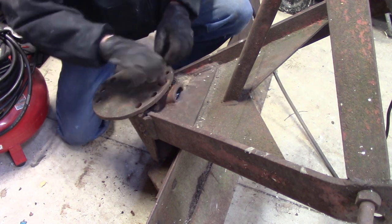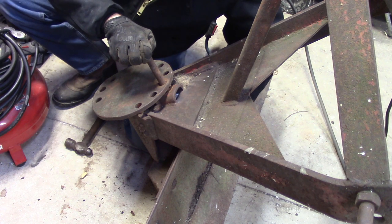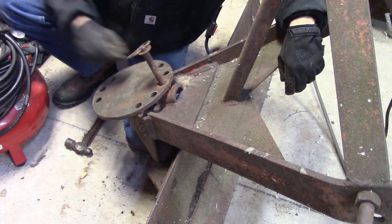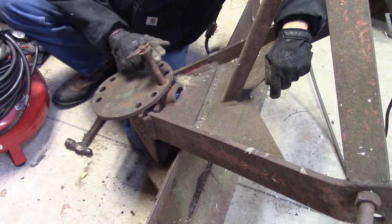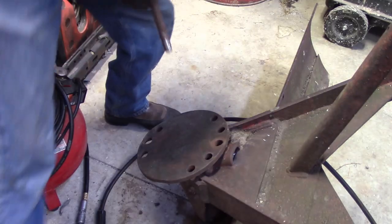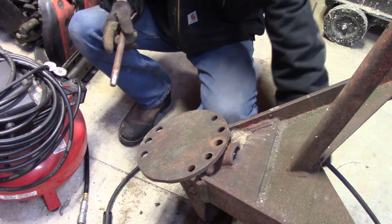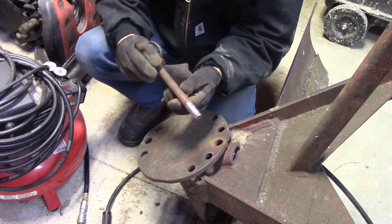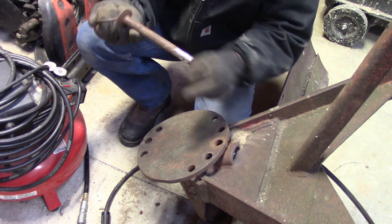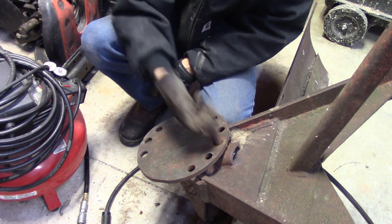The pin's a little tight to come out. I think the problem we're having is this portion of the pin is worn from being beat back and forth, and the tip of the pin, which sticks all the way out the bottom, is not worn — so it's probably a little bigger diameter than it is up here. What I was able to do is roll this blade over on its back all the way and use a long punch with a hammer, come up from underneath and tap this out. I just took it over to the grinding wheel and took just a shave off the tip there. Now it works fine — this bottom piece was just not worn down quite enough. Now that I've cleaned that up just a pinch, the pin drops right in.